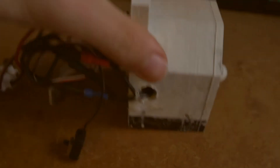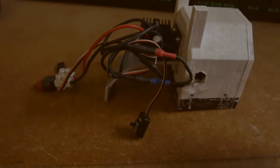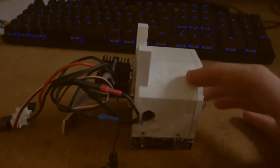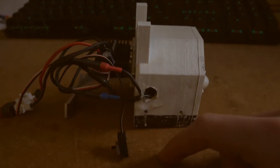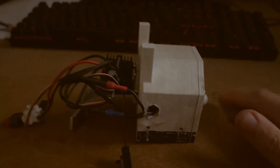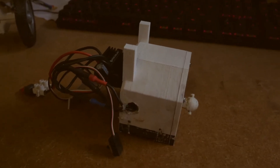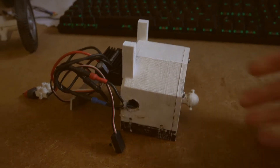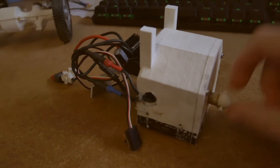This is the motor and ESC assembly, which is very different to my older models. Usually you have the motor mounted somewhere with a gear on it, then another gear to direct it to the chassis, with the ESC hidden away somewhere else. What this model does is have the motor in there — which is the 920 — and it's also got a gear reduction which is 2 to 1 exactly.